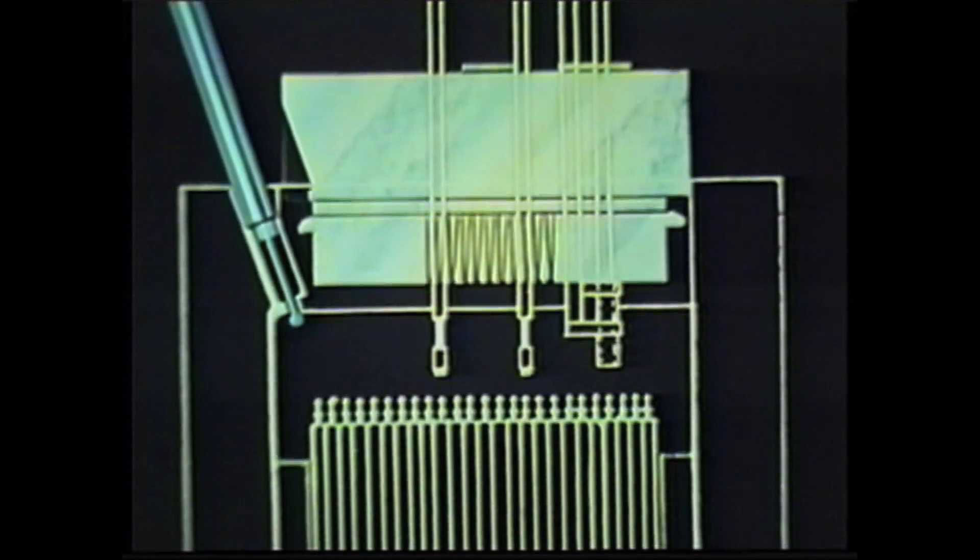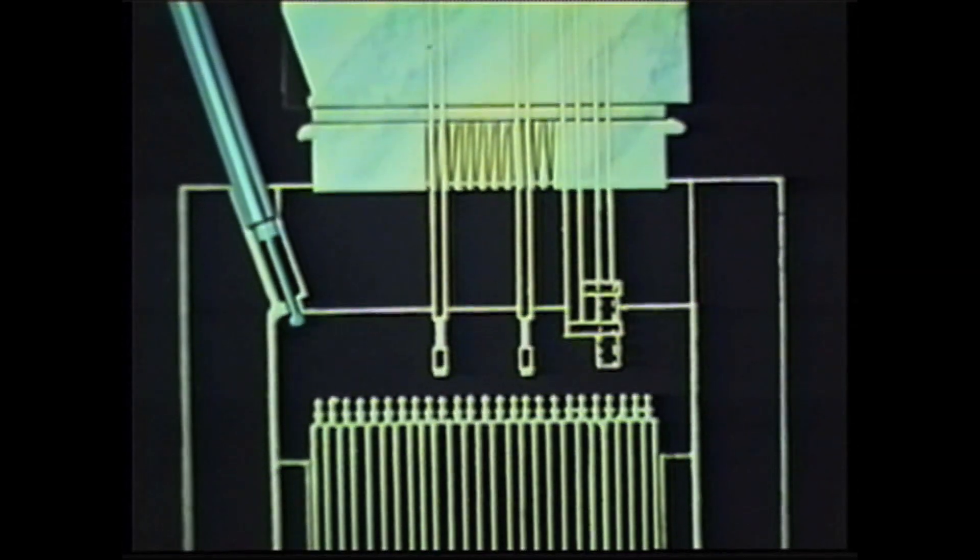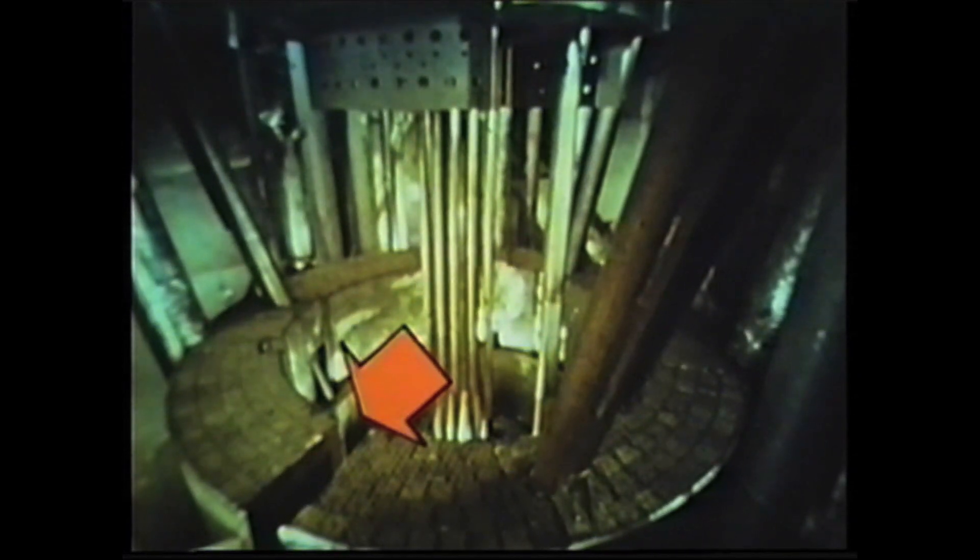Raise the cover. The cover is lifted well above the reactor vessel to allow clearance for the transfer arm to swing a sub-assembly. Notice the slot in the neutron shield through which the lower adapter of the sub-assembly will pass while on the transfer arm. The gripper is raised to up. This sets the pull force limiter and cleans the gripper.